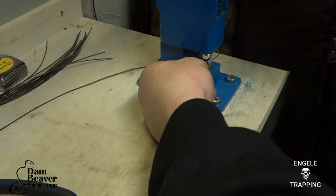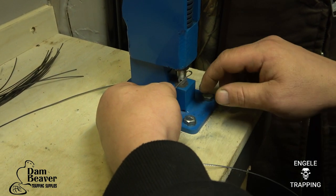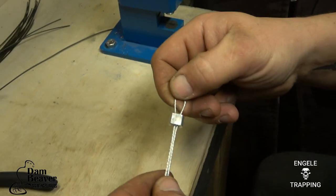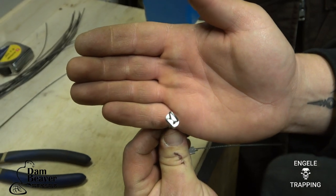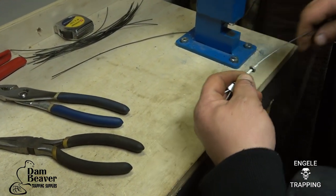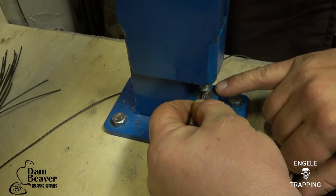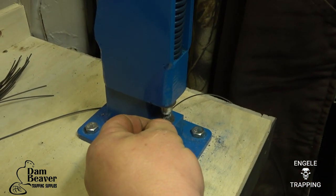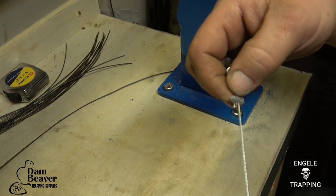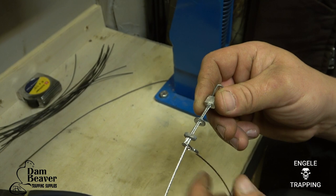Then I'll go to the press, put a little pressure on, making sure that my loop is flat and not twisted, and making sure that the cables are laying side-by-side right there. Then you just press it. You can see how nice they're laying side-by-side. Now that we have that done, we'll slide our washer all the way to the stop and put our heat-treated nut in the press. Put a little pressure on — make sure to leave a tag end at the back side — and then just press it down. You can see the tag end hanging out. The threads in this nut are going to hold really well here, because this is where the trigger of your power ram is going to sit, against that washer. You've got to make sure that's good and tight, because you need that to hold.